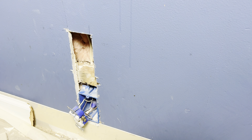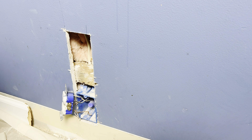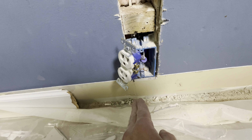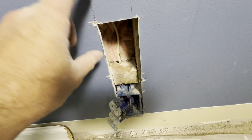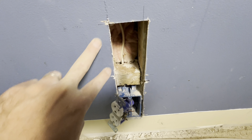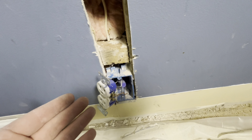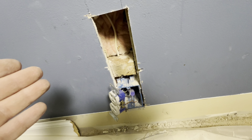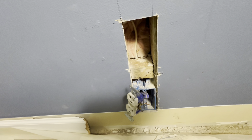I used the oscillating tool and cut it out and it looks like it's going to be perfect for the new box. I discovered that the wire is there and it's going to be perfect. Excellent news about this outlet over here that was in the baseboard — I'm not too sure why they made it so low because the wire is coming from on top. So I'm just going to take out this box, get a new box, and put it on the upper side so it is in a standard position and I can have a baseboard there without it being in the baseboard. I presume it's not the builders that did this. I'm super excited about that — not having to crawl underneath the house.